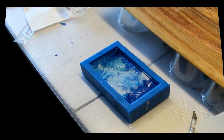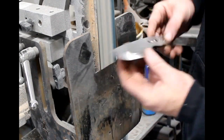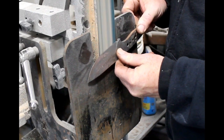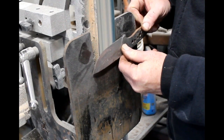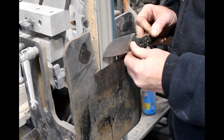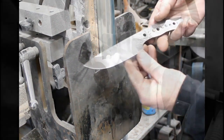I went out and found a knife blank I had started before the holidays — AEBL stainless steel. The rough bevels were already ground and it was already heat treated, so I really just had to finish it off. I went to my 2x72 grinder with a tilt table and a bevel grinding jig mounted to it just to clean up the post heat treat bevels.